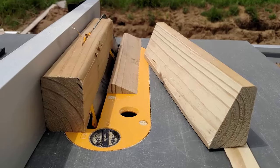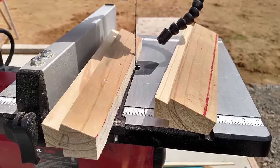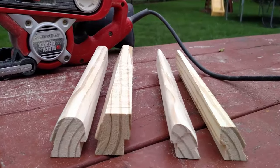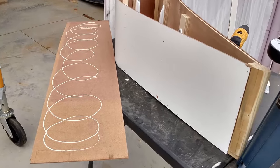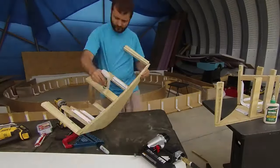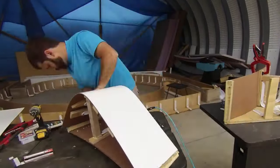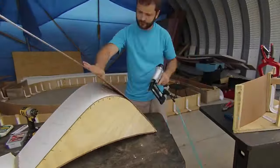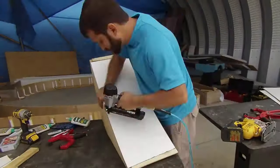The forms for the spandrels, those cutout holes in the ribs, were a bit trickier. I made the series of parts for them with a very carefully planned process so the spandrels would match. Then I nailed them all together with my air gun. I had included a fairly significant draft angle for the spandrels so that I could get them out of the concrete at the end. This made skinning them with that last white layer a bit more difficult, and I had to trim to fit.